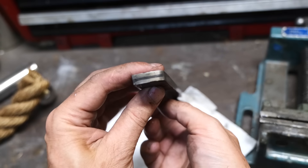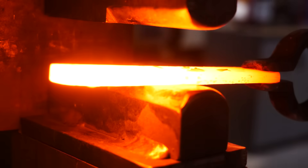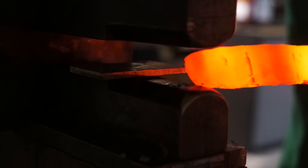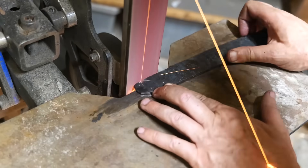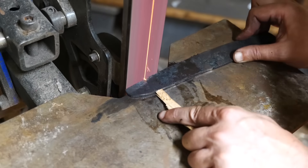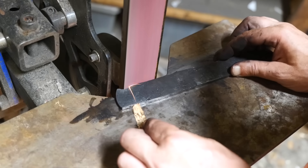We're going to flatten this out some more, start grinding a knife to shape, and while that's going on I'll tell you about the heat treating. We obviously have no idea exactly what type of steel this is or the carbon content, so heat treating is pretty much guesswork. I normalized it at 1600, 1550, and then 1500 degrees Fahrenheit for 10 minutes each, then quenched from 1500 degrees in Parks 50. The as-quenched core hardness was just over 65 HRC, so I walked up a temper from 350 degrees Fahrenheit slowly and incrementally up to 450 degrees, checking hardness as I went — at 400 degrees the hardness came down to just over 60 HRC.